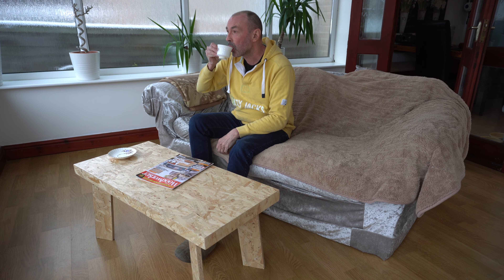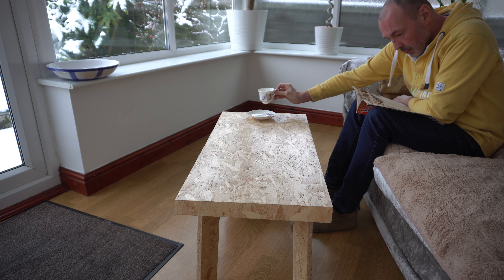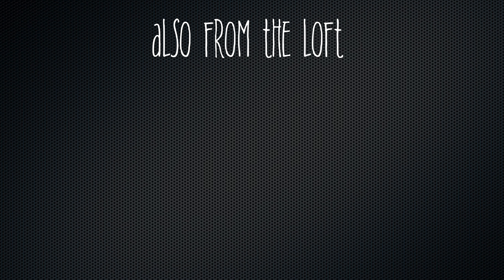Much as with the first leg, the second one was glued and then pocket hole screwed to the underside of the top. Let's stand it on the floor and see what it looks like and conduct a very scientific loading test — looks like a pass to me. The face of the OSB does finish very well but you do have to put the time in with sanding, and that's the main reason why I introduced the waterfall edge — learning from my OSB desk that the edge of the board doesn't finish that well. But this is the same for all panel products: MDF, chipboard, and plywood.